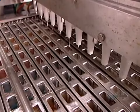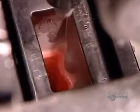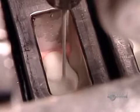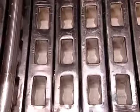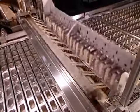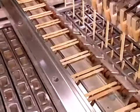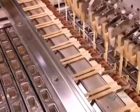The shells are still floating in brine as they reach the filling station. The machine shoots in the ice cream, overfilling the shell a bit to create a 1 centimeter cap. The ice cream begins to harden in the cold brine. Once it reaches a semi-frozen state, a machine appropriately called the stick inserter pops a wooden stick into each mold.